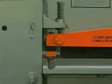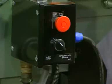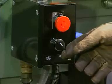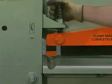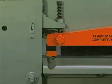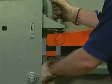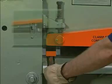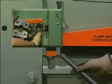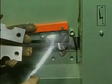This is the round and square bar shear station, which can be operated with the joystick or the remote foot control with limit switches. Make sure the punch end setup/run selector switch is in the run position. When using the remote foot control, move the selector switch on the rear control box to the shear station position. Using the rear control box joystick, raise the upper beam to its full up position and loosen the hold down adjusting nut at the far left. Make sure the three-position cam lock is in the proper position for the metal thickness to be sheared. Insert the material under the hold down and through the knives, then tighten the adjusting nut to lower the hold down, stopping just before securing the material — this allows the material to feed freely during production operations. Different round or square bar knife sizes are available; matching the knife to the material being cut is critical in obtaining burr-free, undistorted cuts. Use of blank knives or turning the round bar knives over will provide full flat bar shearing capacity.